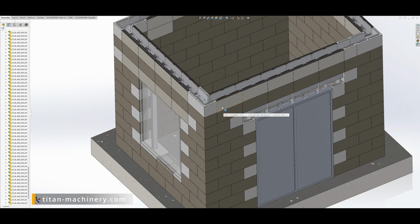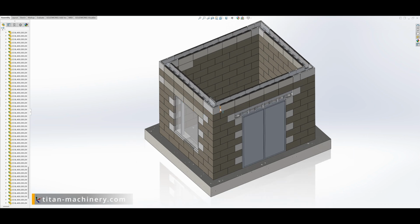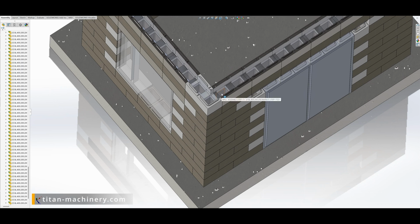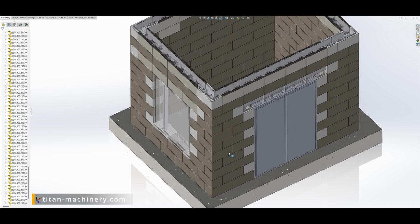This design can guarantee a very high load capacity, so you can produce multi-story buildings very easily. Because this concept is very similar to non-detachable formwork. You just put rebar, pour concrete, and that's it. Both for vertical, and in case you need additional horizontal reinforcement, you can put not only this belt on top of the wall, but several belts like this, using these U-shaped blocks.